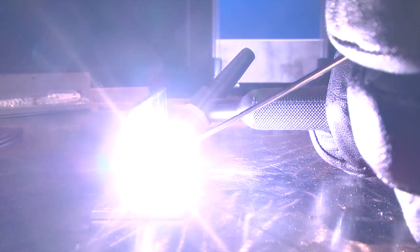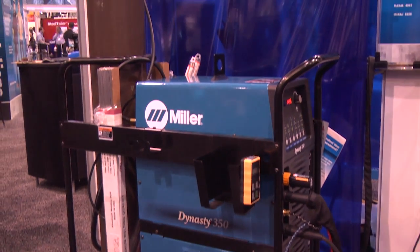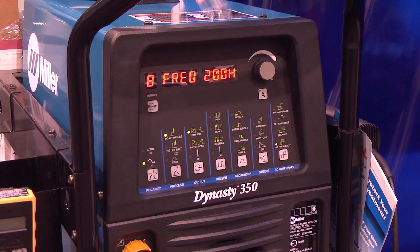Hello, I'm Andrew Fawler from Miller Electric TIG Solutions, the product manager for the business unit. What we're going to talk about today is AC welding on aluminum — the differences between your traditional transformer-based machine and tungsten geometry and arc performance versus the new inverter-based power sources with a sharpened tungsten geometry, better arc control, and better overall weld quality, including how to increase productivity and get better weld quality with your aluminum welding.